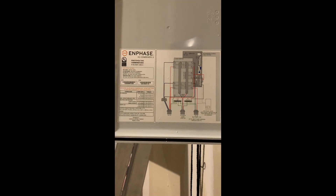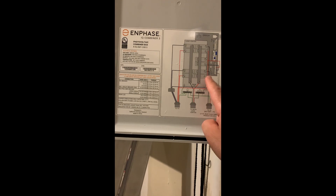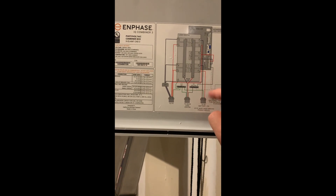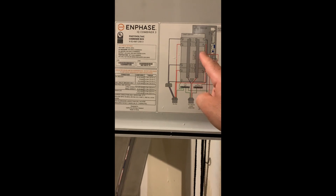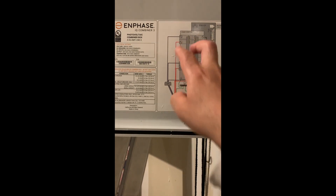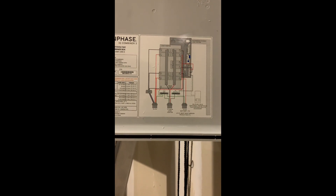The main lugs at the bottom will go back to the AC disconnect. There's a notional diagram that shows how it all fits together — this box can hold up to three arrays, so three circuits. If you have battery storage you can use one breaker for that, but you'd need a pass-through production CT for that fourth breaker. I'll be using two circuits only. Pretty straightforward, nice box — the Envoy is already plugged in and ready to set up once you have all your solar panels and microinverters connected. I'll have a video for that later.